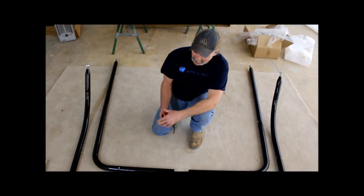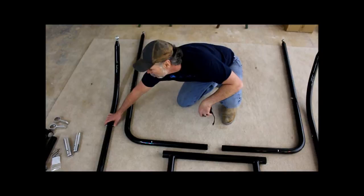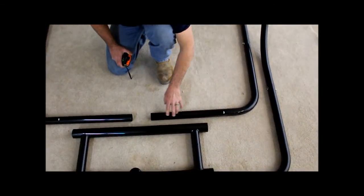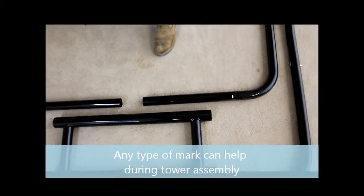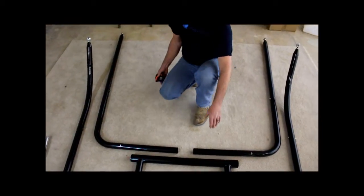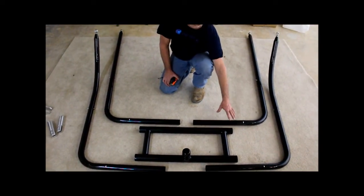We've got the next step of this bigger H2O tower — we've got it laid out. I've stabbed the legs into the corners. You're probably going to have to chase these out, especially on a powder coated tower, just to make it easier to work with the detent pins. I've used a white-out mark on this black powder coated tower as a reference point — we put that at 18 inches. We've got it oriented so you can make sure you've got your corners and your legs opposite for proper orientation. I'm fixing to grease these so they'll slide in and out of the H easier and won't damage the powder coating — if you go in too far you'll have to bring it back out and you don't want it scratched up.